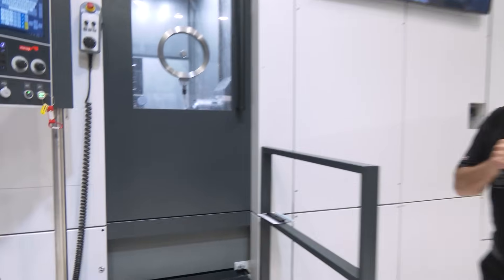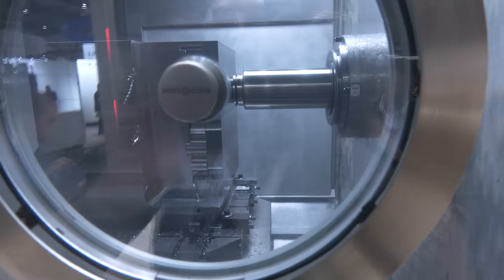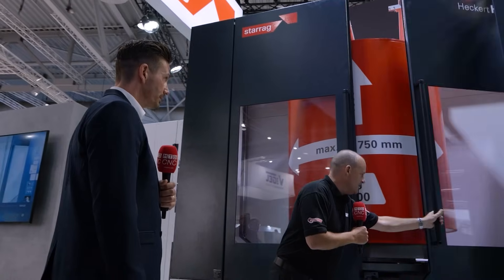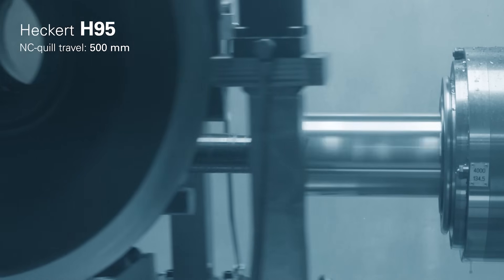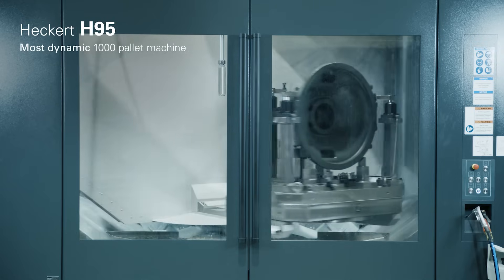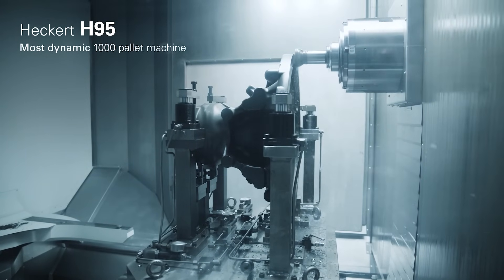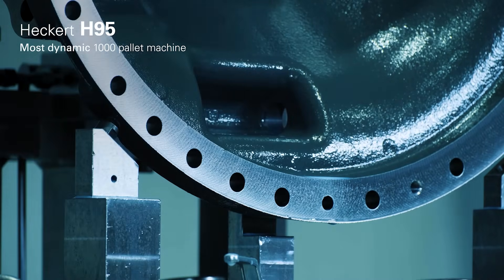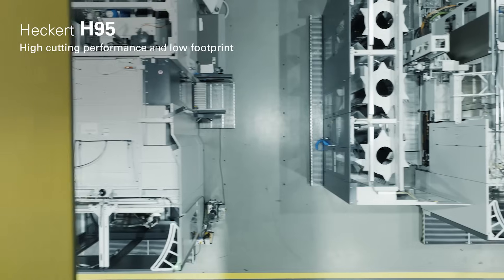Now the size of it — I mentioned it is compact in its footprint, because that's the very nature of this range, but the working envelope is something else. I saw at EMO a huge drum on the second pallet. What can it take? What's its capacity? Well, on this machine we can take two and a half tons on the table, and it's 1.75 metre diameter swing by 1.6 metre height. So it's either fairly large components as a single component on the table, or it's a tombstone with multiple components, different features, different operations done. So each time you pallet change, you're taking off multiple finished components.